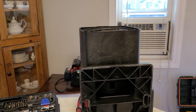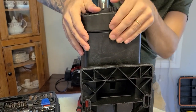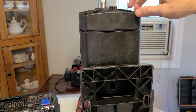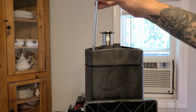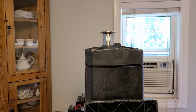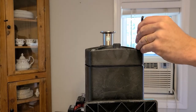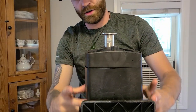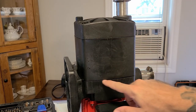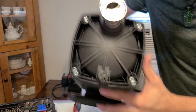The housing is on and our last part is the face here — you can slide this on as well. Then our four bolts go right back where they were. We'll tighten it up with the five millimeter allen key just like how you would tighten up a car tire — in a star pattern so it evenly compresses down. As I'm tightening this everything is starting to compress and the gaps are starting to close in. It doesn't have to be completely closed but it has to be pretty even all the way around.